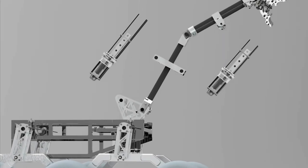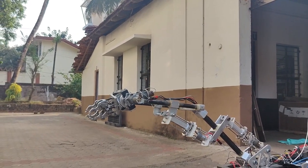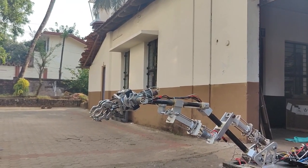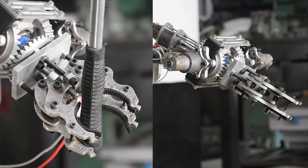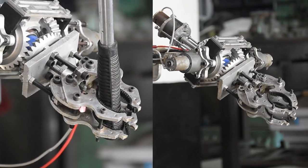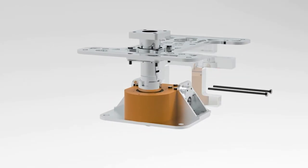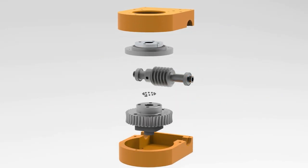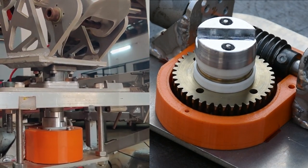The 6-DOF articulated revolute manipulator, fabricated using carbon fiber tubes, features two lightweight custom linear actuators and can lift a payload of 8 kg. The end effector comprises a bevel gear differential and a lead screw-based gripper equipped with power and precision grip to accomplish the given tasks. A zero-backlash 1:40 reduction worm drive in the swivel base provides effective backdrive prevention, while an Oldham coupling accounts for shaft eccentricity, ensuring smooth power transmission.